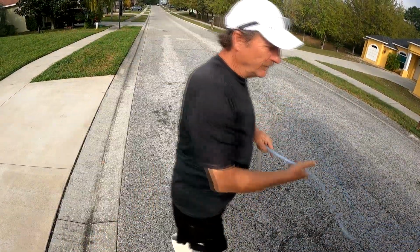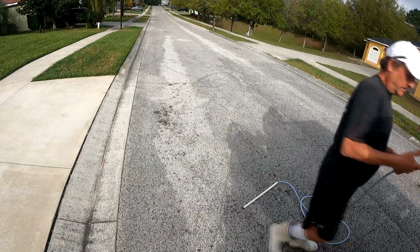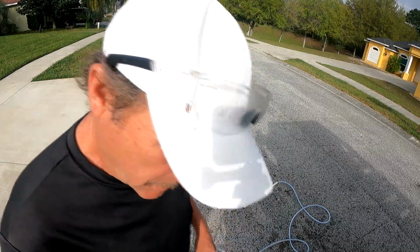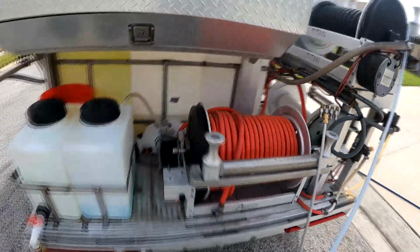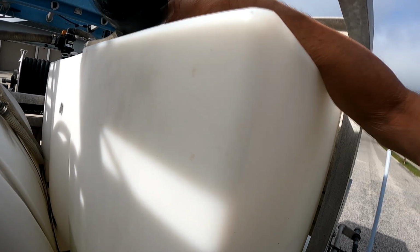Anyway, this is your downstream injector. We're going to plug it into the unloader where I showed you. Okay, we're plugged in. Now most of you start with a little 5 gallon bucket container or whatever you keep your SH in, which is sodium hypochlorite, and it's better known as pool chlorine.